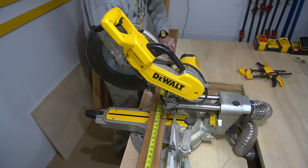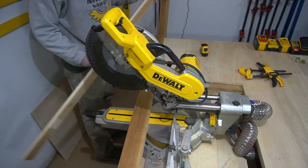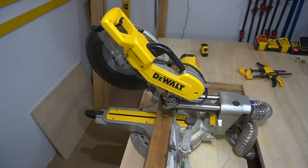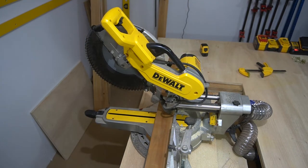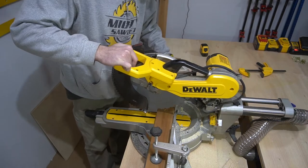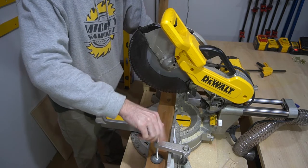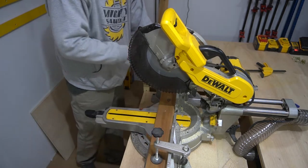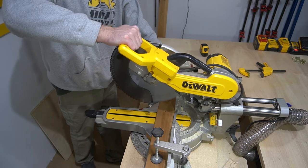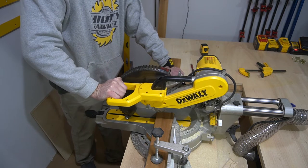Here I'm making the first set of cuts, getting the long pieces cut down first at 60 inches. I'm cutting about two or three at a time. I take the top one off, attach a couple more, get them clamped up so they don't move around. I'm using the top one as a stop block to speed up the process — put one on top, cut, put another one on top, cut, and you're good to go. It's all about being as productive as possible while also being accurate.